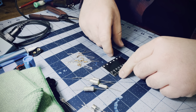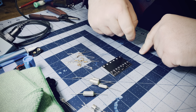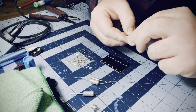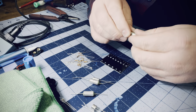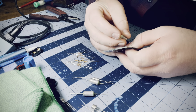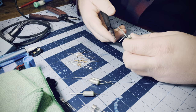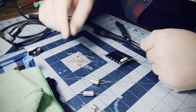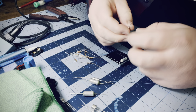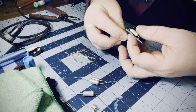We'll install those on the board now and go left to right, since the circuit follows the signal flow from left to right. So we'll start with the input cap. There's lots of bending when you're doing this, so the name kind of works — Tone Bender — doing a lot of part bending too when you're putting it together.